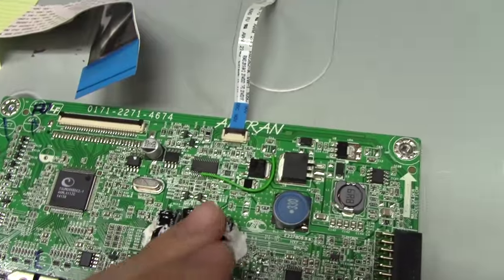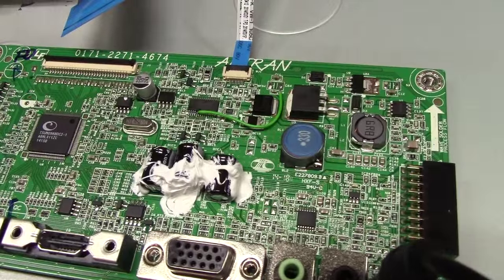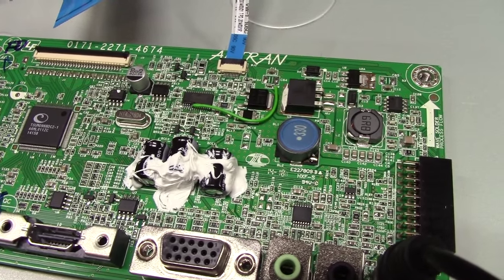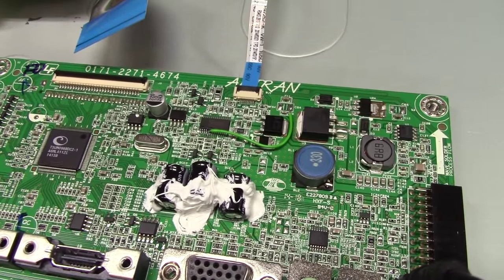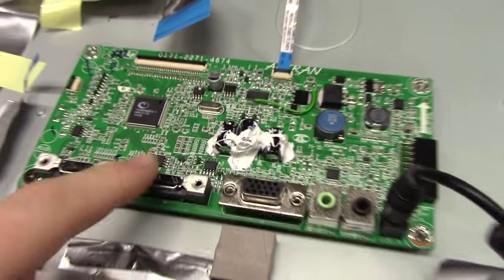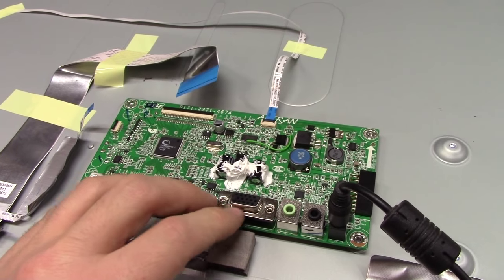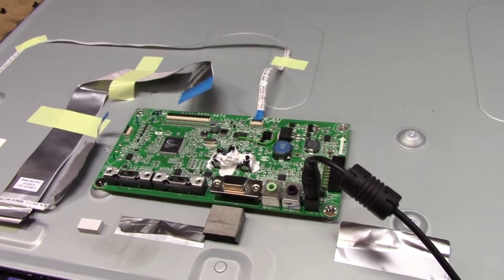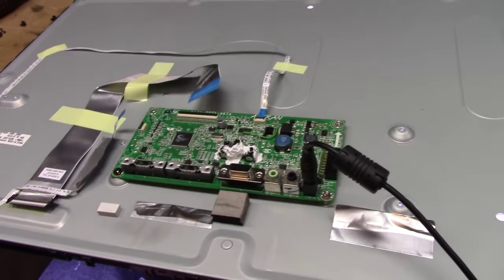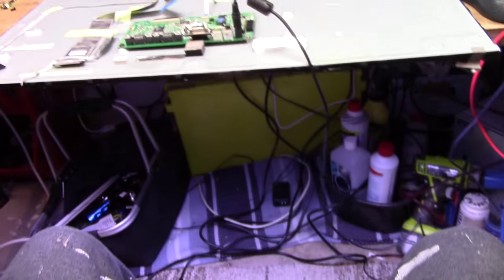What the two pins do: pin 5 is the enable pin, which turns the chip on. Pin 6 is the DC brightness level pin, and by putting it to 3.3 volts you basically just tell it to do full brightness. Since the monitor won't turn on without a signal, the processor will be in sleep and the brightness would just be kind of random. If you don't also jumper that pin, you could probably jerry-rig it to start and adjust the brightness using the front panel controls, but I don't have an LCD panel so there's no point — I don't even need a power-on button.